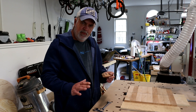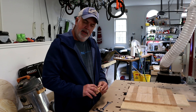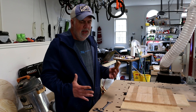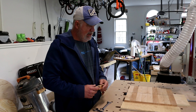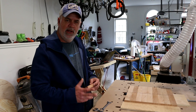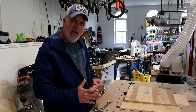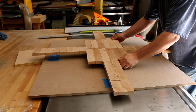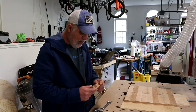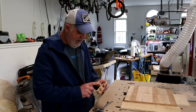It's been about a week and a half since I've worked on this project, mostly due to a scheduled family vacation, but I'd be lying to say the failure at the inlay didn't significantly impact my enthusiasm. I woke up the next morning, looked at it for about two minutes, and thought every time I see this I'm going to regret not trying again to get that inlay to work. So I grabbed a piece of cherry, milled it, glued up a new blank, and went to work looking at my inlay settings. What I found was that the way Vectric teaches you to do a v-carved inlay is to split the difference between the start depth and the flat depth.